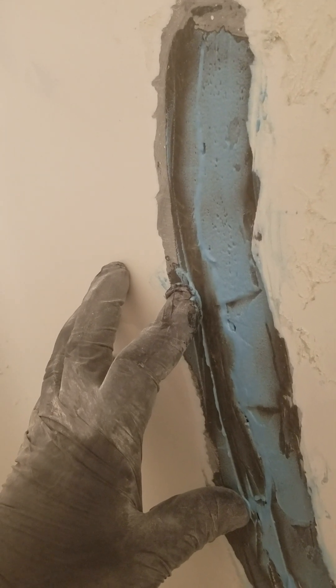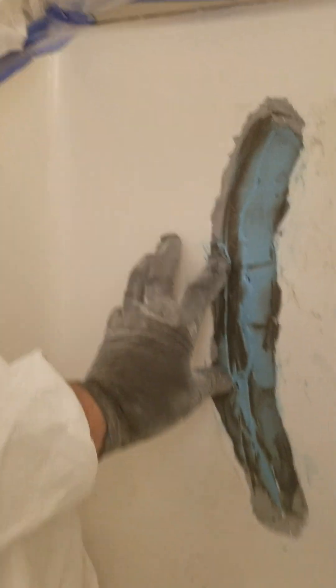This should take like seven minutes — I don't know if my fingers can hold on or not. Alright, so that's all dried up and pretty leveled up. I ground this back down to the crack essentially. It's not level — I dished it out so there's room to fill in, and then I will level that afterwards. So right now I'm going to cut some strips, throw them in there, put some resin, and let that stuff dry and kick off.